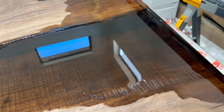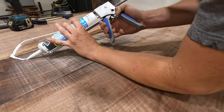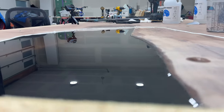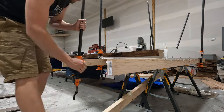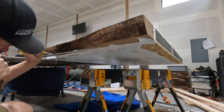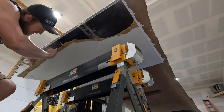In order to get the overall width we want on this table, we did a bookmatch setup, but it kind of left us a little bit of a crotch on the end. In a previous video I recommended using tape for filling these cracks — it works great with fast-set epoxy, but with deep pour, that stuff's like water and it'll go anywhere and everywhere. So I ended up redoing this by building the mold around it, and since I didn't want it leaking, I used a whole bunch of that flex paste stuff — it works great. One mistake I made was using mold release only on the inside where I put silicone, not on the outside, so when the epoxy got past the silicone it was a fight. In hindsight, just coat the whole part with mold release — it'll make your life a lot easier.